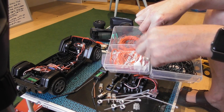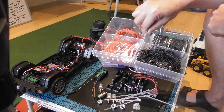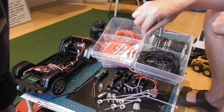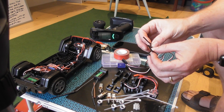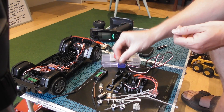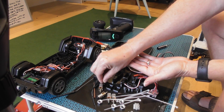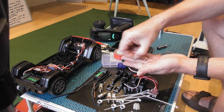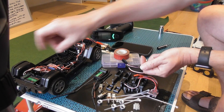Silicon wire — I've got thicker and thinner in both red and black so I can tell which wire is which. I like to buy wire from Component Shop and there will be links in the description. Always use heat shrink when you're soldering — I've got a couple of sizes, 2mm and 2.5mm, and they each shrink by 50%, so use the appropriate size for each wire. There's not too much hardware with this model — just a couple of M2 nuts and M2 screws to hold the on/off switch in position underneath, and one more to hold the body down at the back.